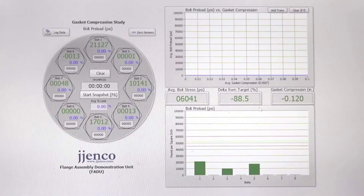As you watch the screen, you can see that as we do the star pattern the actual bolt stresses appear to skip every other bolt. As one bolt starts to increase in stress, another one will start to decrease slightly. This is what is happening in the flange as we tighten, which is why it's very important to use multiple levels of tightening at different torques using the star pattern.